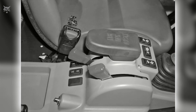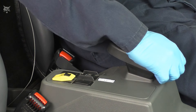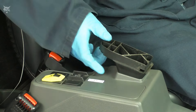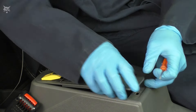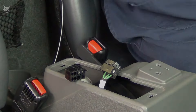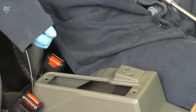On 5600 and 5610 models, also remove the box lever cover. Now remove the cover from the armrest to expose the mounting bolts, then remove the mounting bolts and remove the armrest base. Now remove the switch panel by carefully prying and lifting the panel straight out. Remove the box lever mounting bolt and then remove the lever.